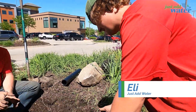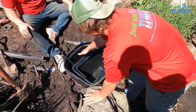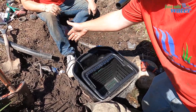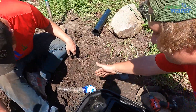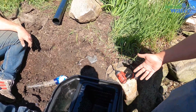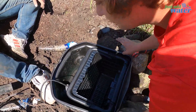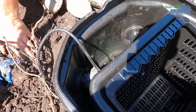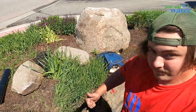We got the new skimmer in — got it all built. We got our plumbing lines in, check valve into the new pump, and plumbing line into there. We reduced it from 3 inch down to 2 inch, which makes it easier for our check valve. Got our overflow glued in there — that's so if the pond does overfill itself, it'll just drain out that line. And now we're going to hook up our autofill, which needs to be drilled just above this line so that if it gets too low, it'll fill itself.